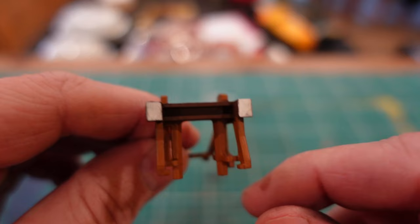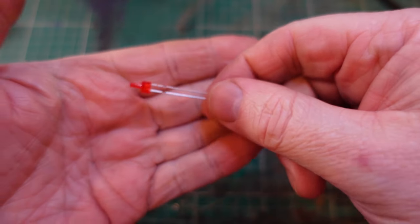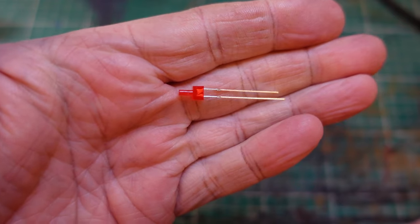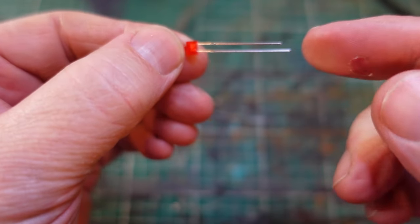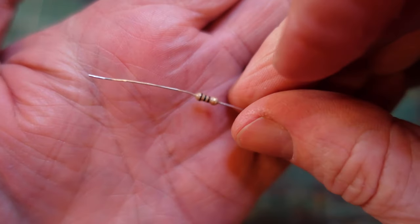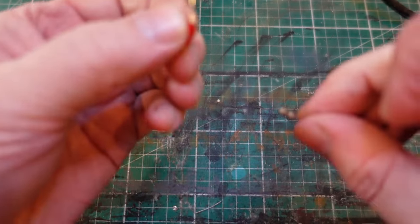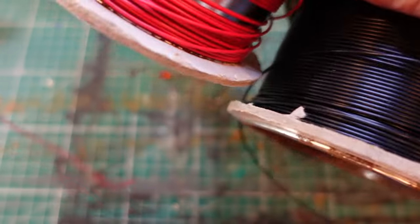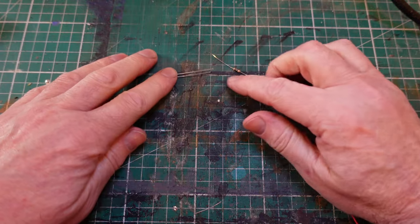The next thing now is to put the light in it, so we'll get the components for that and I'll show you how I solder them together. So components for the lights: I've got a little lighthouse LED here. You can see the shape of it so I can push it into the hole on the buffer. The legs are different lengths — the longer leg is the positive, that's what you need to remember. And of course we're going to use a resistor — this is a 4.7 kilohm resistor. Because I run a 12 volt supply, if I ran 12 volts straight into the LED it would just blow, so this reduces the voltage so it doesn't blow. I'll also be using red and black wire for positive and negative.